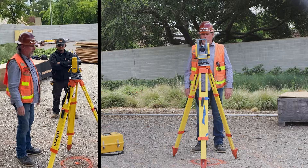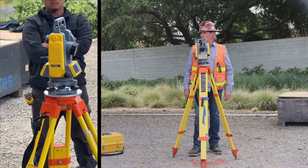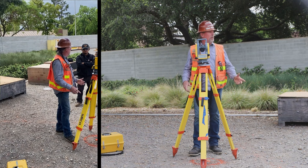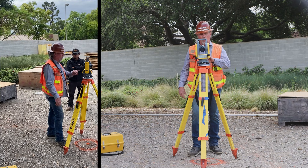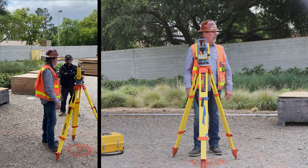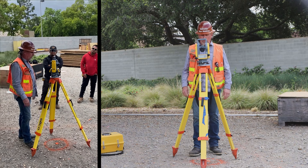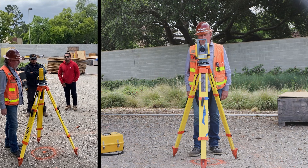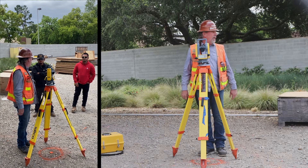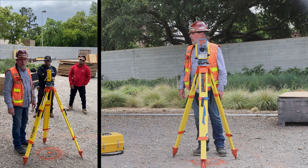Now I can turn my gun on. There's an orange button on each side — turn it on and you'll see it has a digital setting. This gun reads 360 degrees in degrees, minutes, and seconds — like a clock. You start at zero, and going clockwise it increases. There's a little button in the corner that says R for right rotation. If I start here and rotate, it goes from zero up to 360. If I don't switch to left when going left, it'll start at 360 and go down. Once I'm locked onto my target and I like it, there's a button called zero set — push it in and hold it. Sometimes you may need to hit it again. As long as you're close within a second, you're okay.